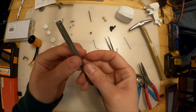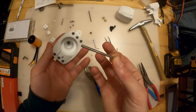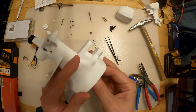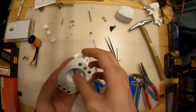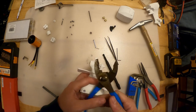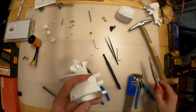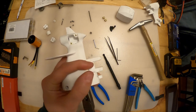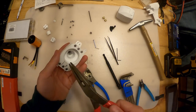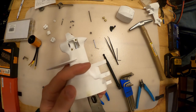Something with squarish sides that you can hammer on would be nice. If you've got any better ideas, I'm all ears. Now I'm just going to check the fit between the gears - we're trying to make sure they're concentric to one another, otherwise the shafts are going to run funny. Just pushing that through and giving it a little push. Make sure it spins relatively easy - yeah, that's smooth, nice and smooth.